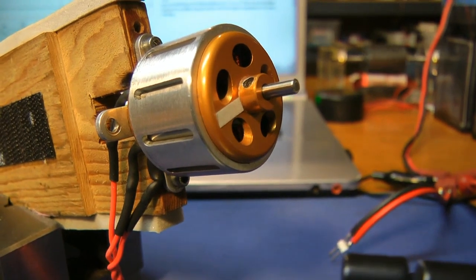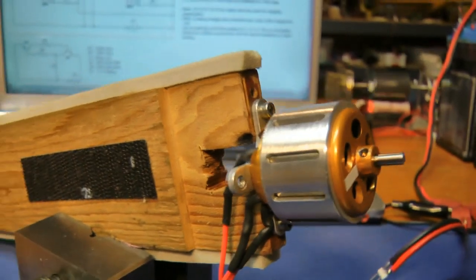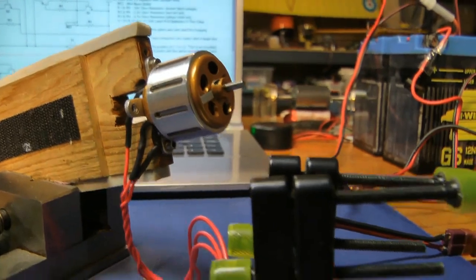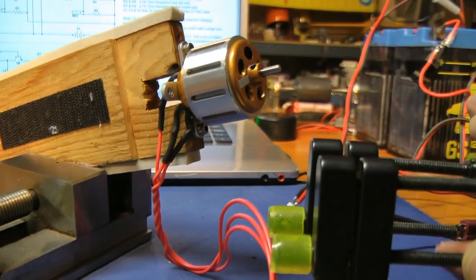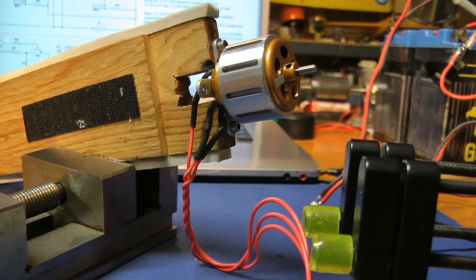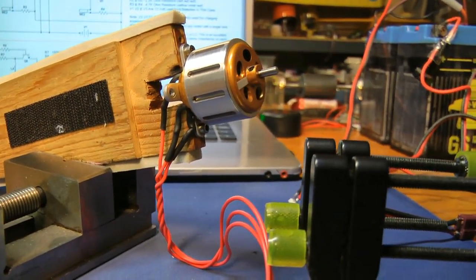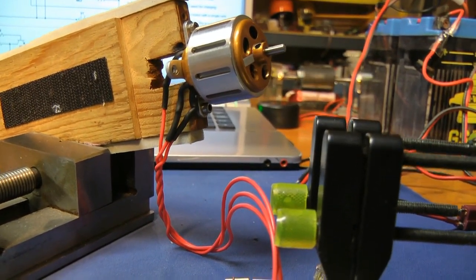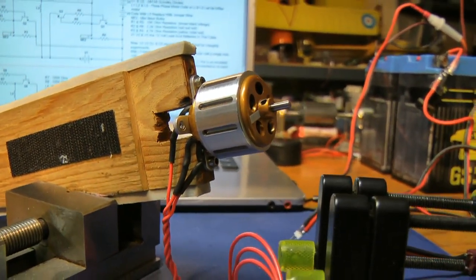So there could be some use for this circuit, but what would have to happen is you'd probably have to change the driver transistor to maybe an FET or something that turns on hard and stays on. Because what I think is happening is when you stall the motor, you slow the RPMs down, your driver transistor isn't turning on as hard, so you don't draw excess current when you're stalling it, because you just don't have the drive. At least that's a probability.